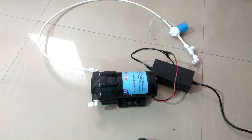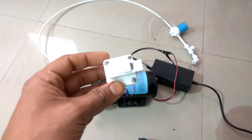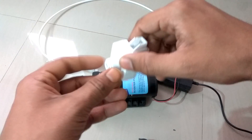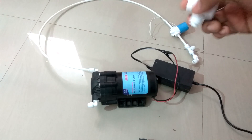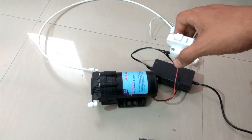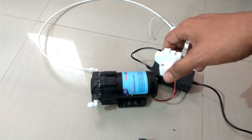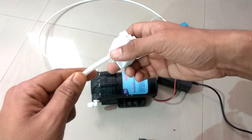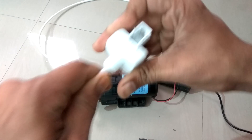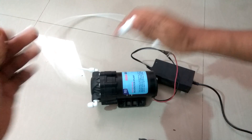I am showing you a very quick way on how to use a low pressure switch. The low pressure switch acts as a protection switch that switches off the entire system if your incoming water is not giving the required pressure to work. This low pressure switch is very simple to use — you just need to put a piece of pipe like this and secure it, and you will require a T-connector.